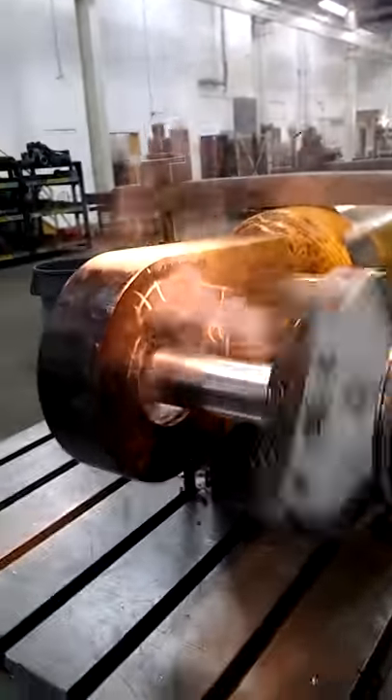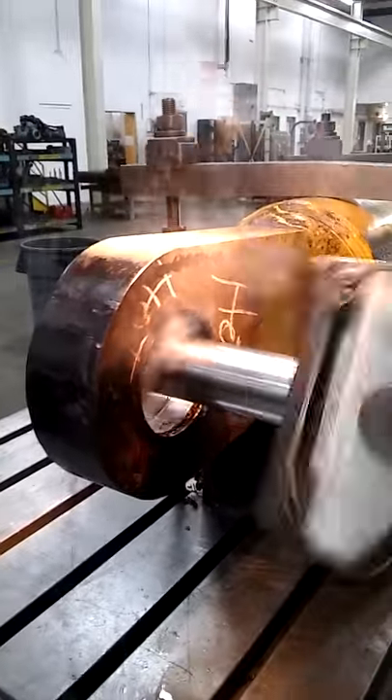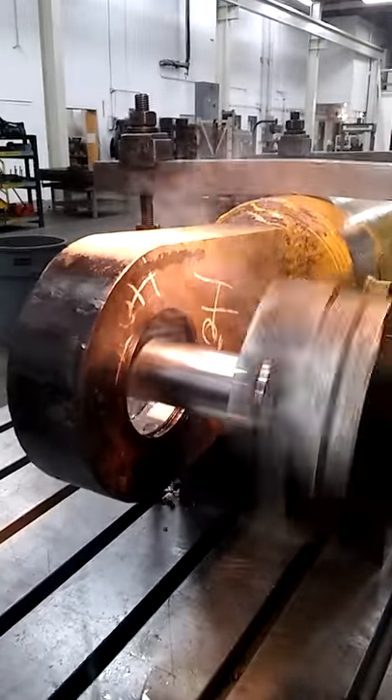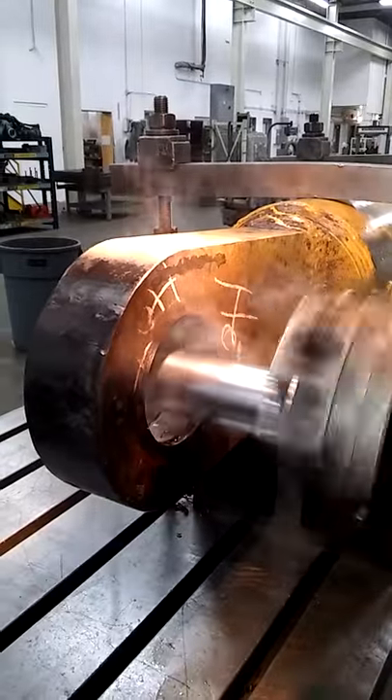So this is a fun job. We're boring barrel eyes for spherical bearings to get pressed in. We have a critical bore about a thousandth. We have snap ring grooves to cut as well. You can see the old bearing here on the snap rings, and you can see the size I'm shooting for — it's really a thousandth and a half almost.